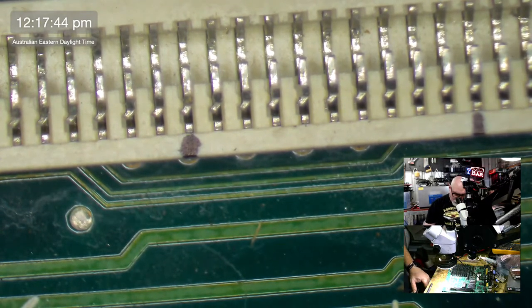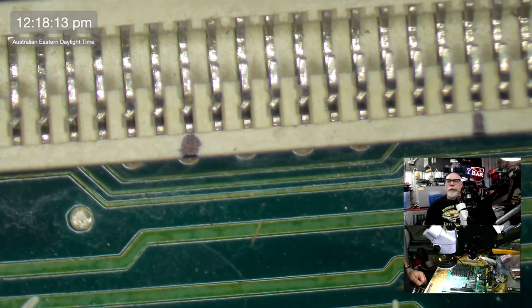So this is the SE30 schematic. And there it is. Actually, I've got it on my computer, I don't need to go to the website. I have it here in a little section of my computer called Mac Technical Files. There it is. And inside that, I have a section for Macintosh 68K schematics. And in that, I have the PDF, the one that I'm after. And we're looking for page 10. That's the address lines. And we've got the data line pin matrix. So we've got the address line pin matrix. So what we're going to look for here is...